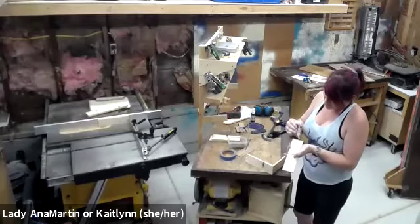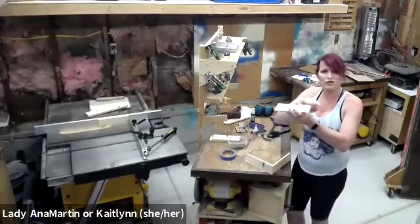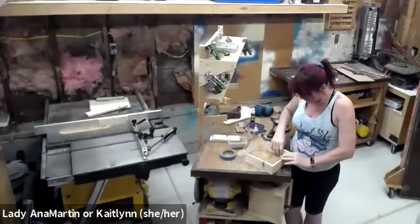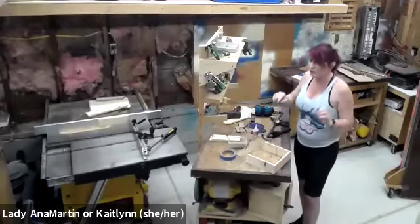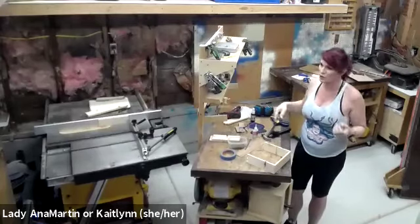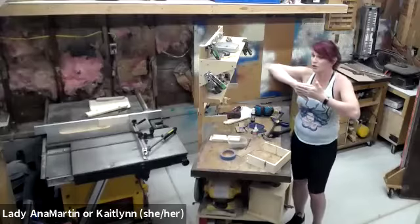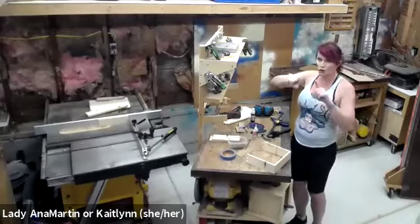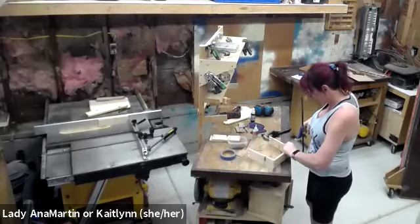So because it's cut on an angle, you have a little more glue surface, but this is a 45 degree, so it's a 1:1 rise over run. You know what that means? It's not until you get to like 12:1 that you're gaining strength. That is to say, for every unit up you're going, you're going 12 units along. So if we were gonna stick a 2x4 together, we wanted to glue them together to stretch that board, then for every inch of thickness of that wedge, we're gonna go up a foot. I'm not sure if that was clear or not. It didn't sound particularly clear to me.